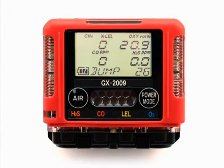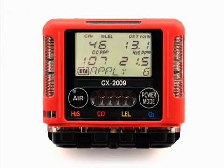Press and release the power mode button. The LCD will display the current gas readings and the instrument will count down from 30. Turn the regulator on-off knob counterclockwise to open it. Calibration gas will begin to flow.